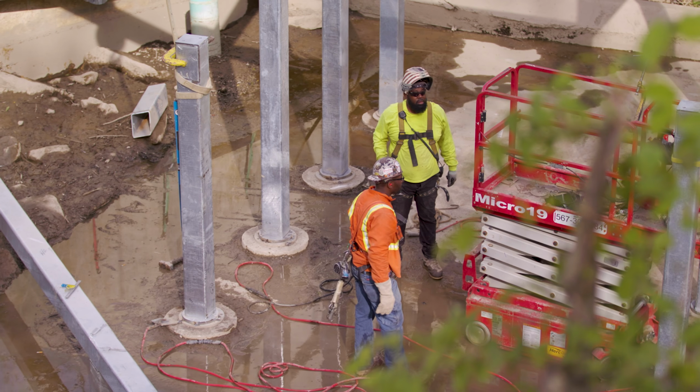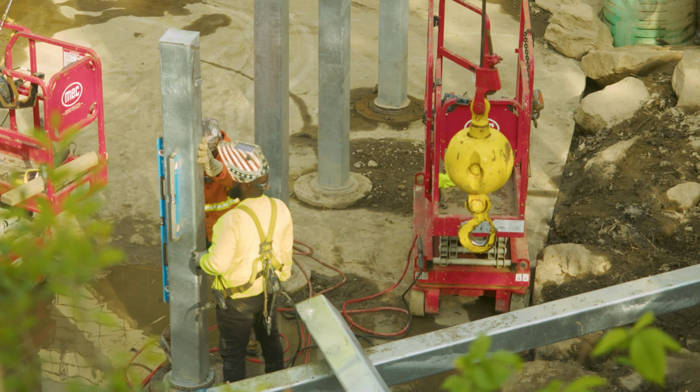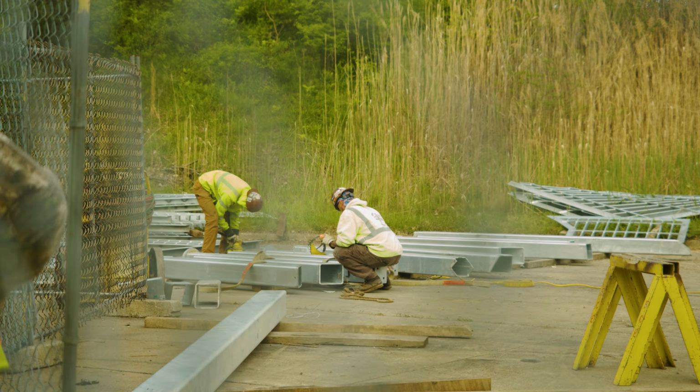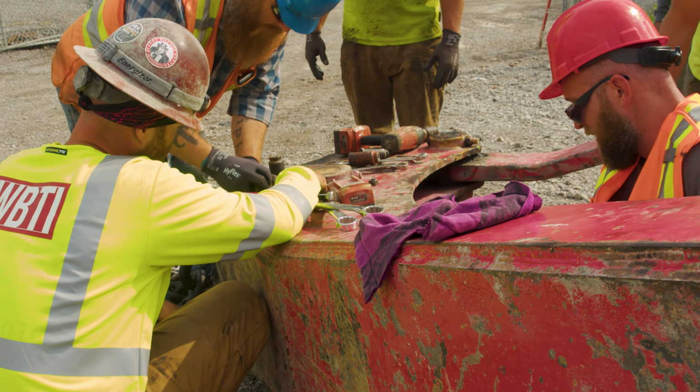Once you do learn that, you know what, I can put a marlin spike or a screwdriver into that hole and then just turn it and loosen it up, you might start carrying it in your pocket. Most riggers, most technicians will have some kind of a tool belt with them. That's all you need. You're gonna have a screwdriver in there. You'll have one that'll fit that hole. You're gonna probably have a set of adjustable wrenches in there or even a pair of pliers. Put it on here and open it up, you're done. Very, very simple way to do that.